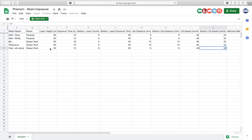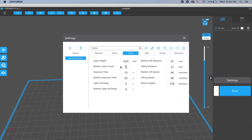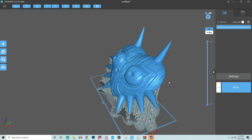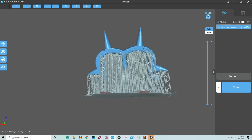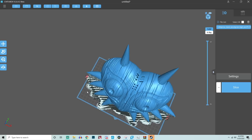The reason this has become a standard resin for me for MSLA printers is it's got incredibly low cost, really high quality prints especially in the gray, and it's very low odor. On their spreadsheet for the approved resins, it has the recommended burn-in layers, the burn-in layer cure time, the standard layer cure time, and instructions for how thick you should have your walls if you hollow your model. I just copied over their settings into Chitubox. I imported the Majora's Mask model from Thingiverse into Chitubox, scaled it up as big as I could on the X and Y, tilted it back, and then hollowed it out because I didn't want to use an excess amount of resin. They recommend a wall thickness of at least two and a half millimeters, so I opted for three and a half millimeters.